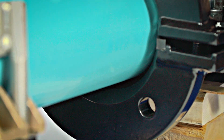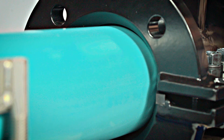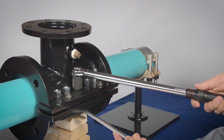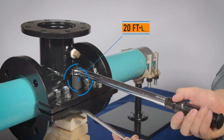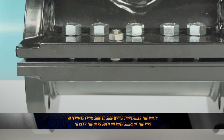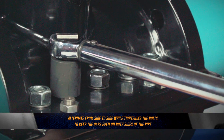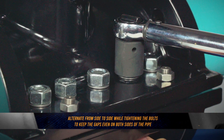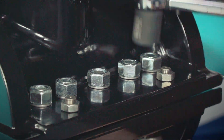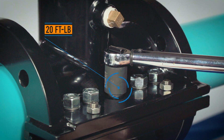With the outlet set at the final position, block and shim the sleeve to ensure both tapping sleeve ends are concentric to the pipe and the outlet remains properly positioned. Next, using a torque wrench, tighten the side seal bolts to 20 foot-pounds, keeping the gaps between both sleeve halves even, end to end and side to side. Start with the inside bolts and progress outward, repeating this pattern until each side seal bolt is tightened to 20 foot-pounds.